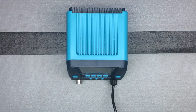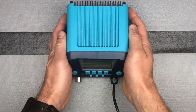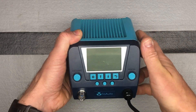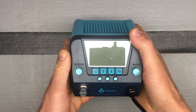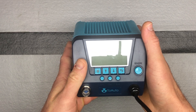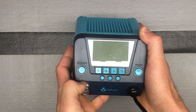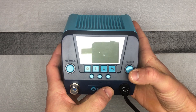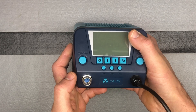Let's check this out and kind of set it up as we go. Here is the main part of the device — this is how it's going to come to you in the box. We can see that your hot air gun is going to come connected. Looking at the buttons, you've got a soldering button, a brightness button, a couple of arrows to select what's on the screen, and a return button. Channels 1 through 3 are across the bottom, a rework button over here, and then your plug-in for your soldering iron is right here.